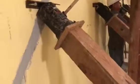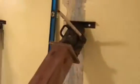Again, it's just simple physics that we're using on straightening this wall. The excavation on the exterior is key, because as we've said in so many of our videos in the past, it's a lot easier to push against air than it is against earth. So once this setup's in place, it takes maybe a minute or two of extending these bottle jacks to straighten the wall back to vertical. So it should be a very quick show, but again, I just wanted to do one quick video showing the setup. Once the straightening of the wall begins, we'll have a second video of that.